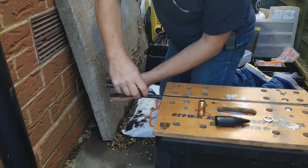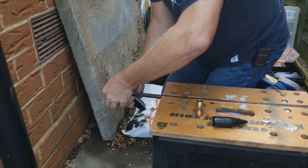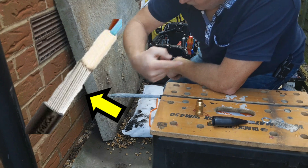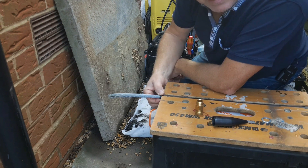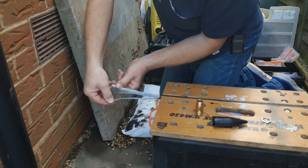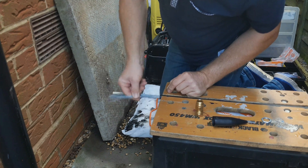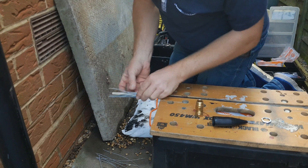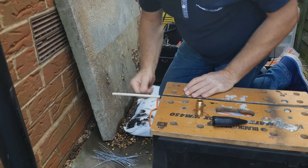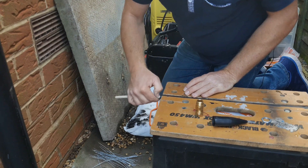Now that you've scored the armour, with a sharp knife cut along the length of the outer sheath and take the outer sheath off. The armoured wires are wound helically down the cable before the sheath is applied. Take hold of a few wires at the end and unwind them from the inner, then where you've scored them, bend them back and forth a couple of times and the armoured wires come off. Repeat that until you've got all of them off. You should have a nice neat end — do make sure that you've not gone through the armour and nicked the inner sheath.